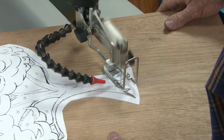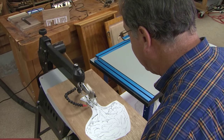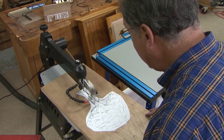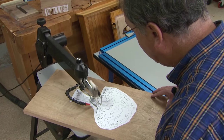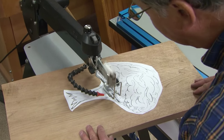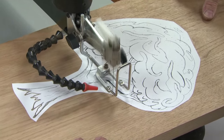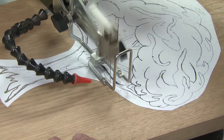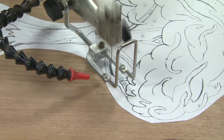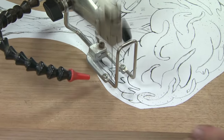I've switched back to the number five because I just like the cut on a number five. With a normal flat blade — not teeth all the way around — I have more control, and so will you. Spiral blades are only there for one reason: to give you the capacity to outsmart a board so that you can work with a smaller scroll saw and get around the neck. I'm not too worried about staying precisely on the line, because after all, it is a tree — a natural form.